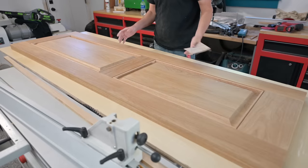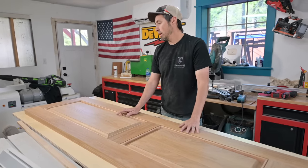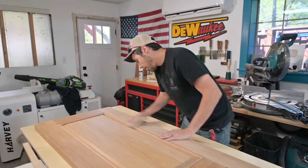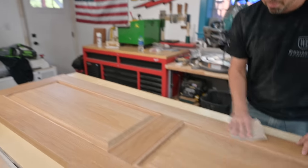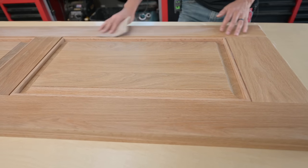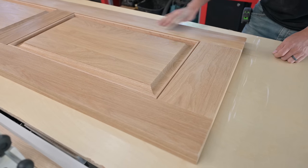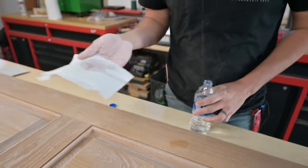This side will be completely done. I'm going to finish this side of the door, get that second coat on it, then flip it and repeat the process for the other side. After the second coat, I'll lightly sand it again and wipe it down with some water, because I'm making polyurethane dust that I can just clean up with water and a wet towel.